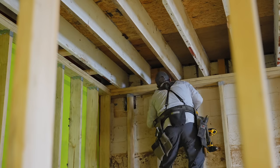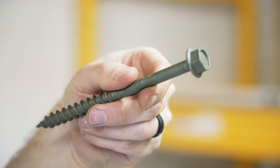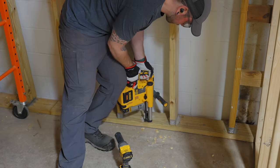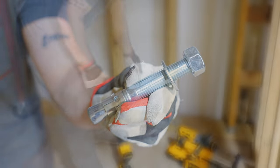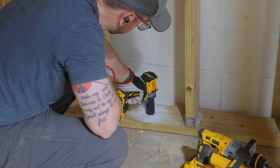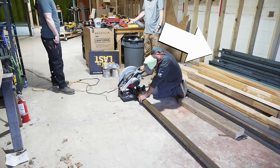After laying out the steel locations, we needed to add blocking above where the steel would be installed in the right wall. The steel would be attached to the floor system above with six-inch lag screws, and without blocking the steel would only have been attached to the top plates instead of being tied into the entire second-level floor system. While the Perkins guys worked on the blocking, Eric and I installed massive three-quarter-inch wedge anchor bolts at two-foot on-center spacing as specified by the engineer. These will provide an extremely strong connection between the bottom plate and the slab. Once the blocking was done, a few weeks later I had bought all the steel C-channel and we could get started fabricating and installing the steel supports.